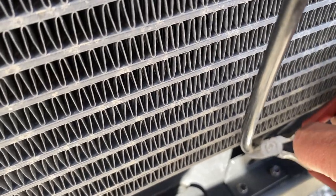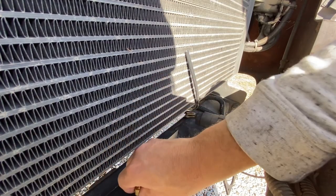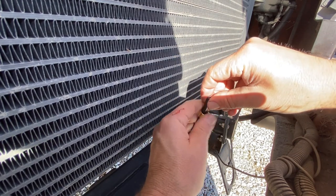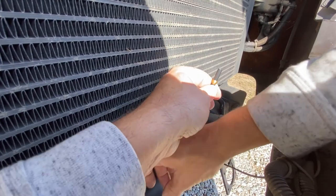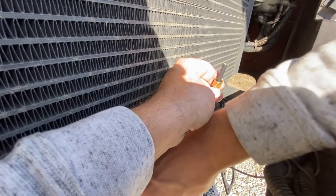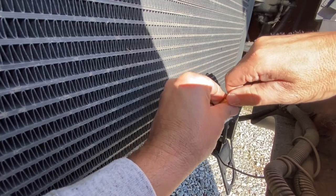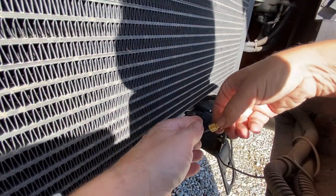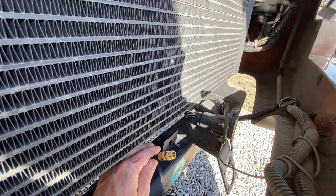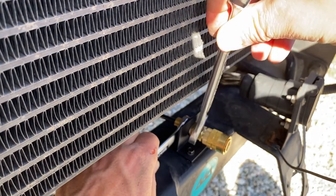Let's cut it to length. The fitting comes with a little brass ferrule in there, and you also have to have a brass insert. To connect that up to the hose: first you put the ferrule on, then the barrel on, then you put in the insert. So you've got the insert, the barrel, and the cap — and it's ready to connect. Grab the wrench and tighten it, stick it in here, and connect it. There's a washer to make sure it's all tight. Just a couple of turns to tighten it up, and then this portion of the job is complete.